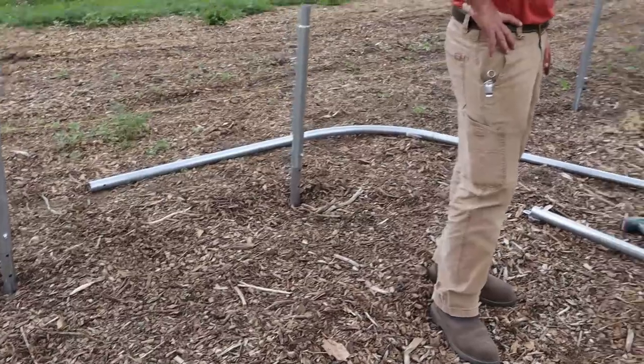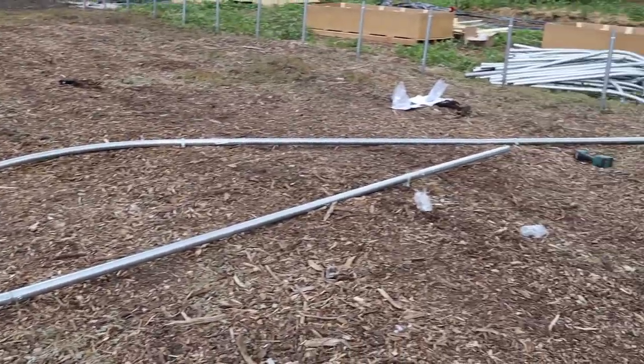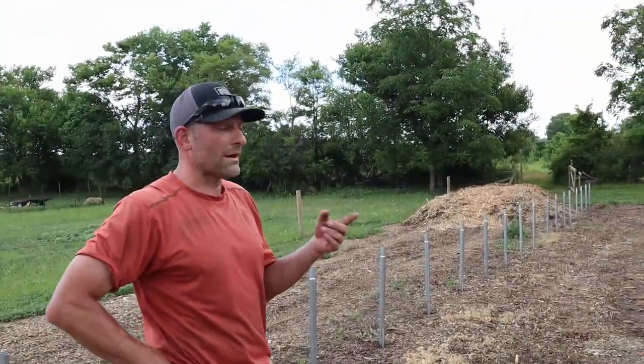This is your second one that you're doing. Yeah. So we laid it all out and we decided it'll be much easier to do a complete truss on the ground, right? It's a little heavier, but then tip it up. Easier than working up there, and it helps stiffen it up for when we tip it up. As you install them all, they kind of just start racking into place.